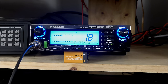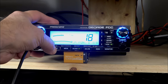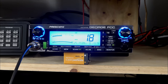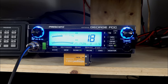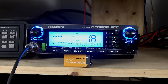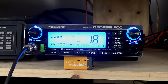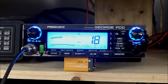We also have PA mode — if I press and hold, we're now in PA. Press and hold again and we can get rid of that. Now, memory: if I press this button real quick, memory has been activated. This allows me to save up to four different channels in four different modes. So I can have channel 19 AM, channel 38 lower sideband, channel 16 upper sideband, and channel 4 FM — all in an easy to navigate selection: M1, M2, M3, M4.